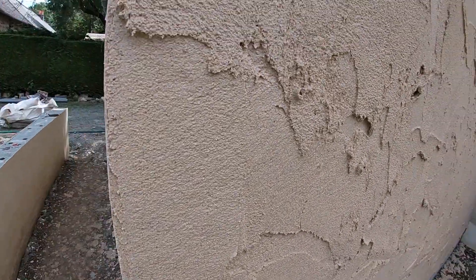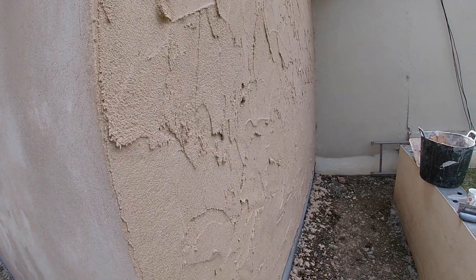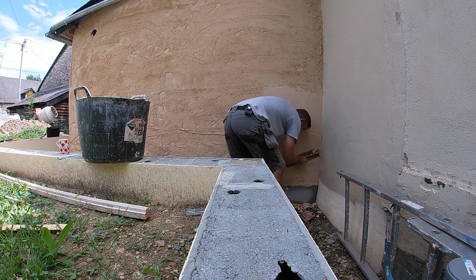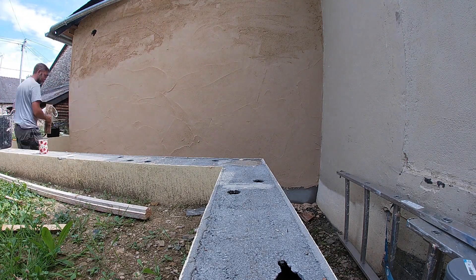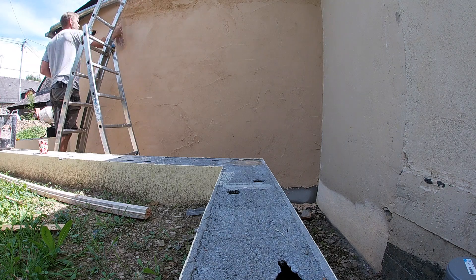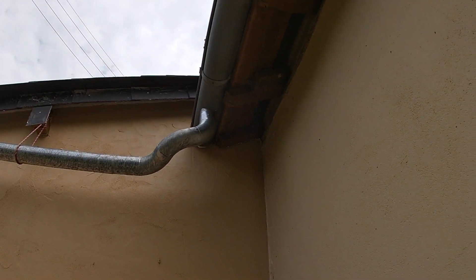Just has to be the right depth and on the wall. I've smoothed it out a little bit with a straight edge, then done another mix but slightly wetter this time — the normal 10 litres and then add a bit in, and just go over the top and layer it up. This time for the second coat you can smooth it off a bit more, and the smoother this stage is the easier the next stage becomes. This is what you should end up with after your second coat.